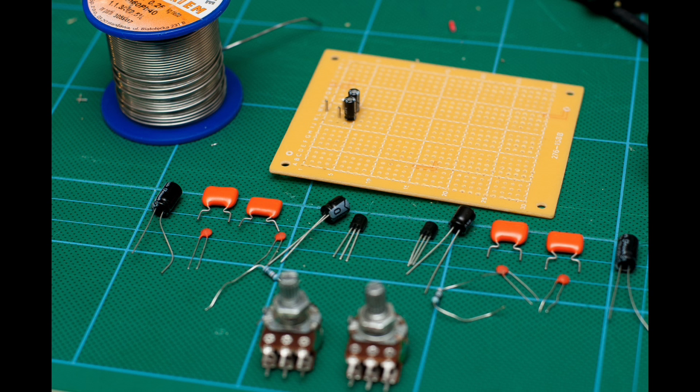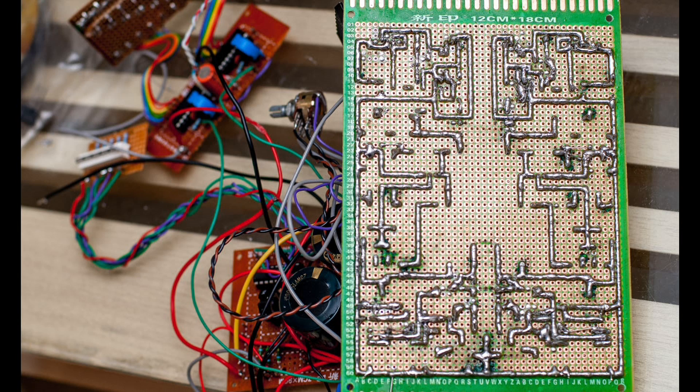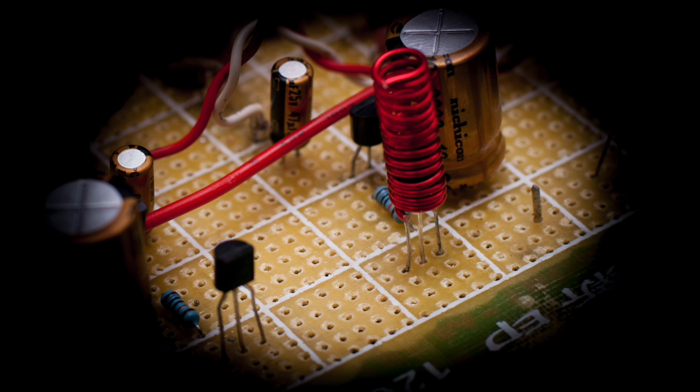I did make a big mistake though. Once I built it, the transistors I used were general purpose transistors with a TO92 casing, but they got hot and I started getting uncomfortable with that — I don't want to open this thing up and start replacing transistors. As far as I know there's no way to attach heatsinks to these, so I decided to make my own heatsinks with my pretty red reel of magnet wire. I cut pieces of it and merrily coiled it around a drill bit, happily creating springs to attach to the heads of the TO92 casing and dissipate the heat.